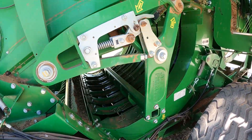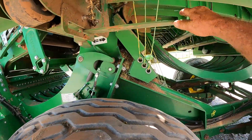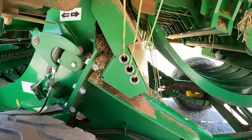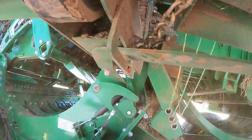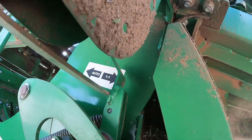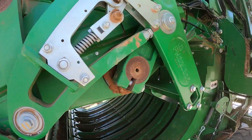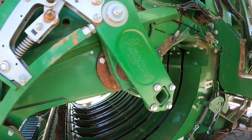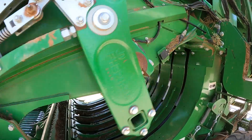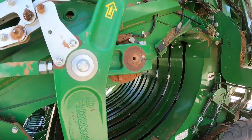A quick way to check that to see if it's actually working like it's supposed to: go underneath on the left-hand twine box and switch this lever to one-to-one. You'll see what I'm doing here — we're going to pull the lever back. Now we've got it switched to one-to-one, so it's going to fill the chamber and then unlatch it.